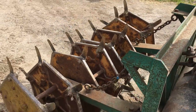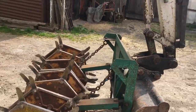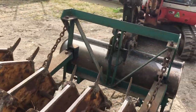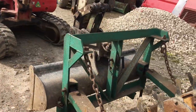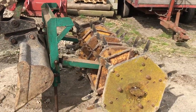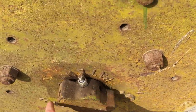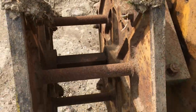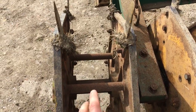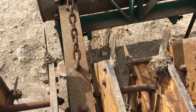That's the old slitter - bloody heavy. I'm just moving it back into the shed and that's why it's handy to have a digger: instead of hanging it on a tractor I've got one U-bolt and I can just pick it up and be on the way. I took this end cap off - they're just straight on that square shaft - took this unit off, turned it 90, put it back on, and that means the teeth are staggered.